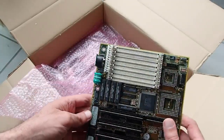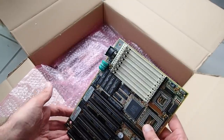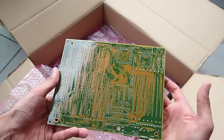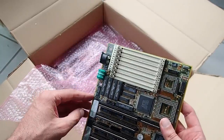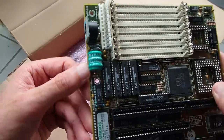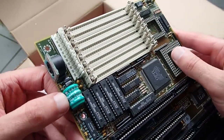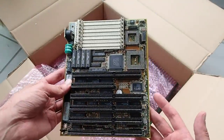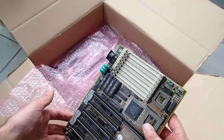The first board is for a 386 DX, without a CPU. I already have a similar board and it is quite neat — I like how compact it is. The battery is still installed and unfortunately leaked quite a lot, but the backside shows almost no oxidation, which is a good sign. This board is based on the OPTi chipset and is designed for 386 DX CPUs. The cache is already maxed out at 128 kilobytes. There is quite a lot of oxidation around the leaky battery. The good thing is it already has a variable clock generator, so the CPU frequency can be set with jumpers.